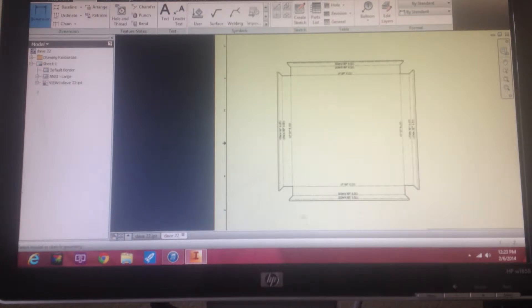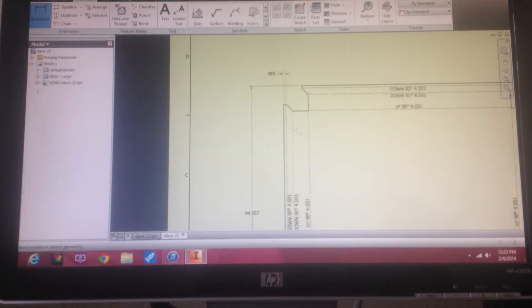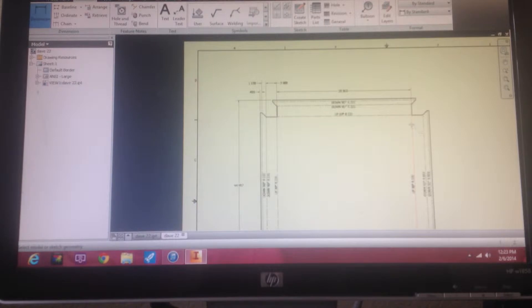So now we're going to come in here and put some dimensions on there. I'm going to show you the standard practice at H&K — they were taking the overall sizes, and then coming in, the brake guys wanted the center of the bend lines. Which side you pick is kind of important. First, see that I picked the left, so it comes on the left. Now I'm going to pick on the right first and there you go — they're finding each other pretty well. I like to align these, you can see how it found itself pretty well there.